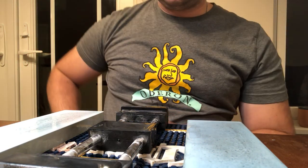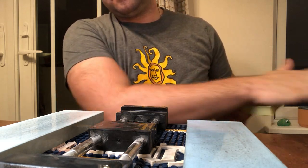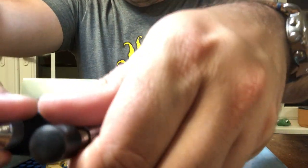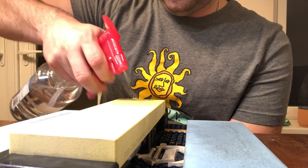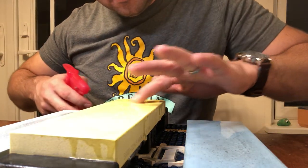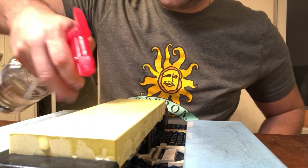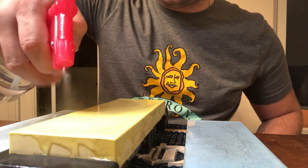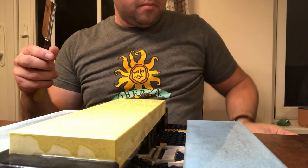And this here underneath my stone holder, it's an old Corona bar mat that is just perfect for catching the water and the swarf coming off of the stone. And so that's my tool. I know some folks have what I think they're called honing baths, or maybe I'm getting that term wrong, but to me this works out really well. Pretty much all you got to do is I take my paper towels that I've been using to wipe my blade, and I soak up some of that water, and then I carry it over to the sink and dump out the water.